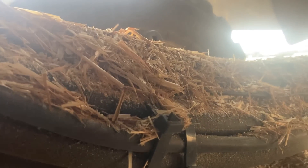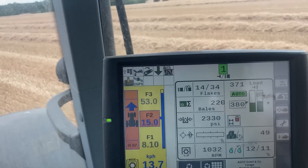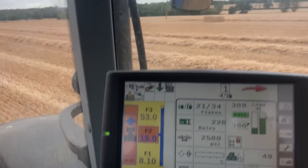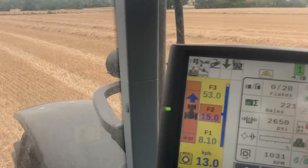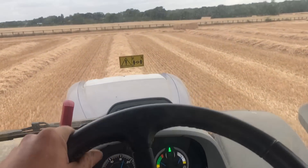We've cleaned it down every day - look at all that on the axle. That's why there are such fire hazards with these balers, because that is blown down meticulously every morning and there's dust everywhere. The straw is so dry it goes through and just bits fall through - you can see on my fingers - and they don't take long before they build up. We're going again now, tied them off top and bottom. Doing about 34 to 35 flakes per bale at the moment. Up and running properly now - more bales, here we go.